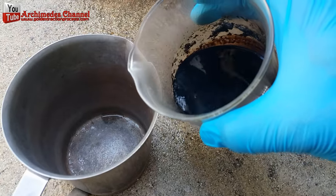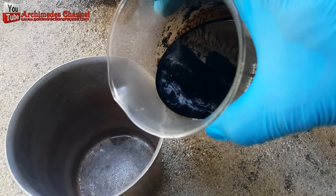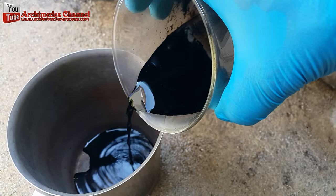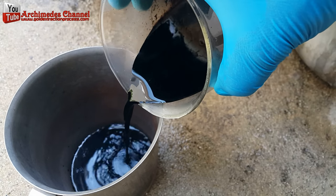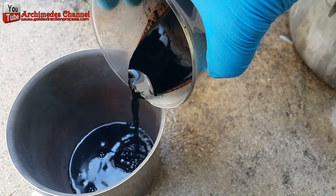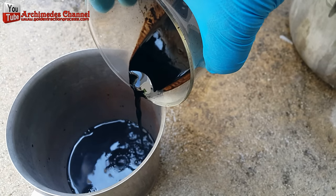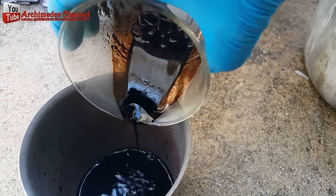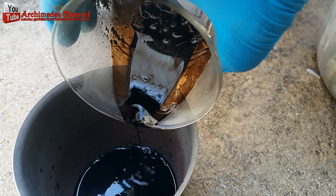After the compound is dissolved completely, you can pour off the sulfuric acid and wash and clean the gold wire with clean water. Importantly, you must be aware of the danger of sulfuric acid while pouring out and when cleaning the gold wire. Sulfuric acid has a violent chemical reaction when it is mixed with water. You may have to separate the fibers of the PCB.